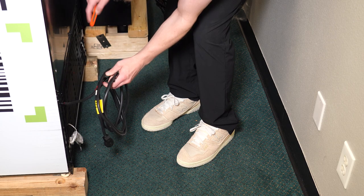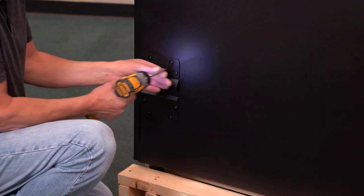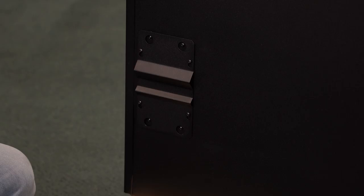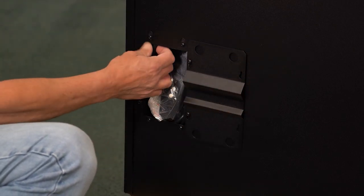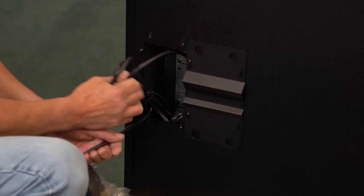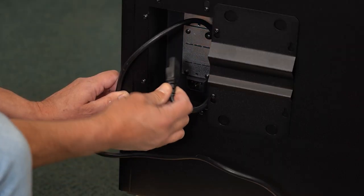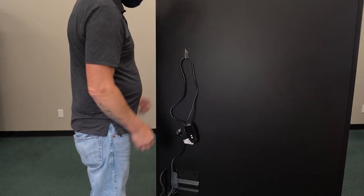You can find the cooler's power cord on the back. Locate the power cord on the back of the snack machine as well. Loosen these four Phillips screws to remove the cover and place it off to the side. Take out the power cord. Make sure the power cord is securely and properly plugged into the machine — during transit, vibration can cause this to become unplugged. Attach the cord to the back of the machine.